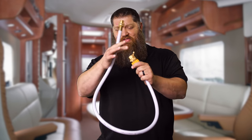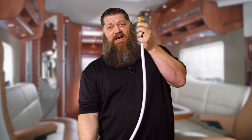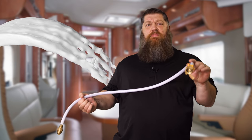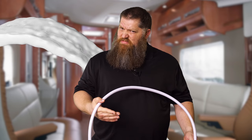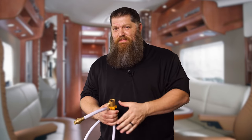Here's where this fitting comes in — this fitting goes into the water heater, and this fitting is the shutoff valve. Because once I pour that vinegar in, do I stand there for eight hours? No! All you have to do is turn the shutoff valve to the off position and drop it — no vinegar is going to come out. You come back eight to twelve hours later, simply open it up, and milky water comes out. Once that milky water comes out, fill it back up, hook it up to a water hose, fill it back up, and pour that out until it becomes clear water.